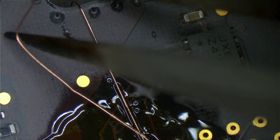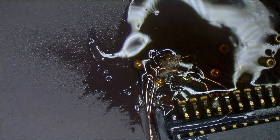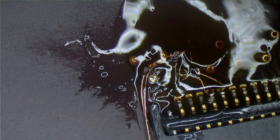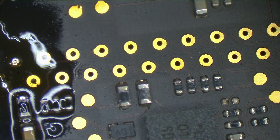We can move that back into place. This obviously has to get ultrasonic and all that because that's just too much flux — even by my standards that is too much flux. We got our two wires in place. If you're smart, you'll figure out a way to fit a wire even smaller than this through the board and just solder like that. I'm working with 40 AWG magnet wire and this is pretty much as small as my wire gets.